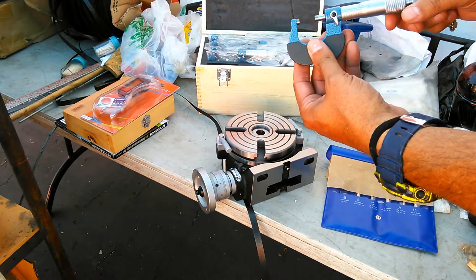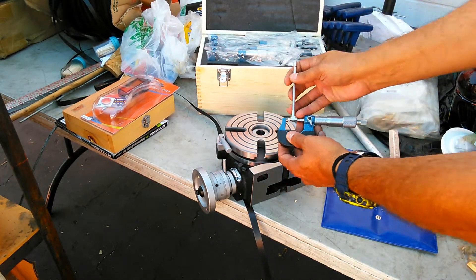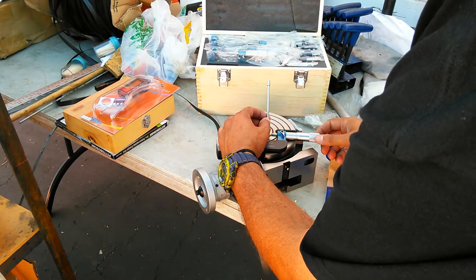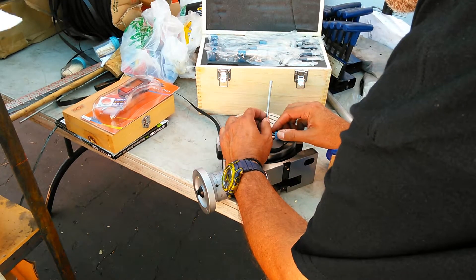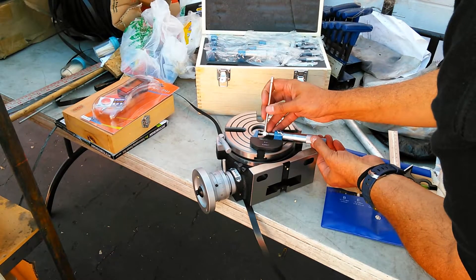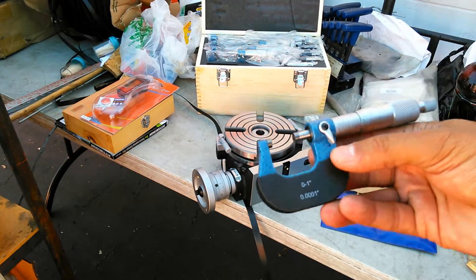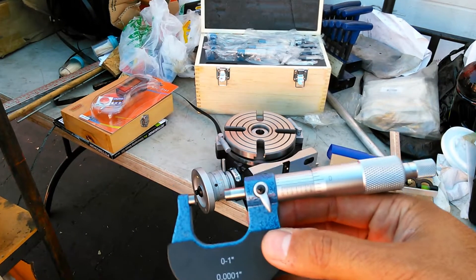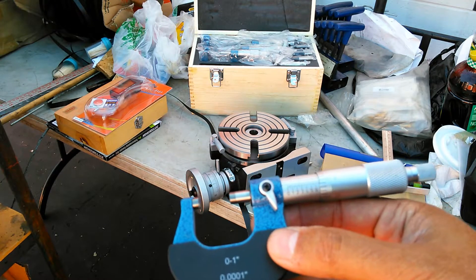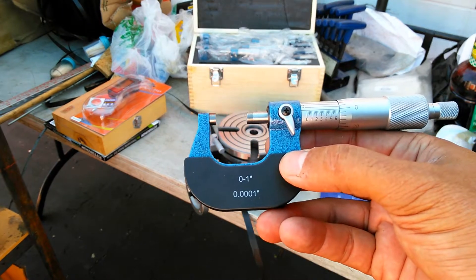I'm going to take my mic and put it between the anvils. I've already done this once as a warm-up before I shot this video, so this gauge needs to slide into the anvils. The anvils need to be exactly straight in there. If you read the mic, we've got .6, .63 — it's almost .630, but it's actually .629 I believe. I'll have to read it once I get off camera, but that's how you get an accurate measurement out of a hole like that.